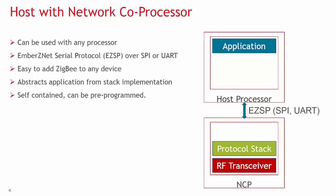This platform can now use a dedicated application processor, which can be anything from an 8-bit MCU to a sophisticated 32-bit or 64-bit embedded Linux system. The added flexibility of a host with NCP model provides the ability to add wireless mesh networking to an existing application architecture in a modular way. Since the stack is self-contained in the NCP, it is easy to maintain the stack functionality or upgrade the stack with new features with minimal impact to the application.